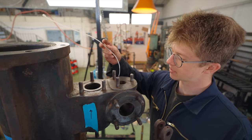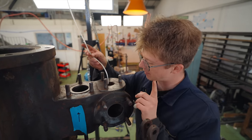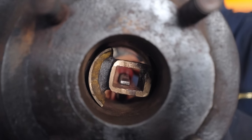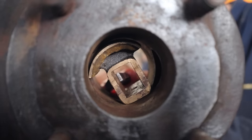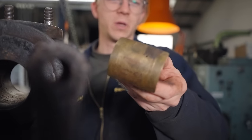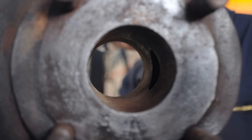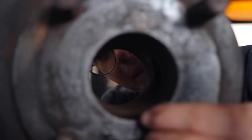I've been able to make some discoveries about exactly how this works. Air inlet — I didn't know where the air traveled from there, but I've worked it out. It goes at this angle around this little jacket, then enters at the back. That means this thing is restricting the steam flow from the rear — as it opens, more steam goes in; as it closes, less steam goes in. There's also a little teeny hole on it, presumably so it trickles in steam all the time. The bore itself is pretty rough and ready — it needs about a millimeter off the diameter at minimum to get that surface clean.